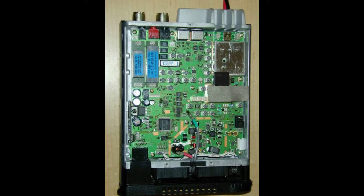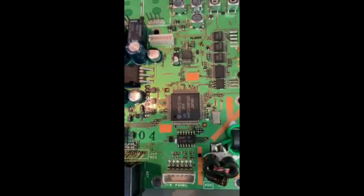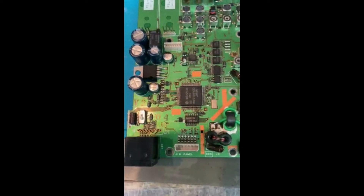Now that we've covered the high-level view, the exceptions, and functionality, let's actually dig in. We want to buy an 857 or 897 and we want to know whether or not it's a D. The best way I know to do this is by actually looking at the main board. If you're in the process of purchasing a radio from someone, it's a simple thing to remove the top cover, snap a couple pictures, and send them so you can confirm what you're purchasing. I'll show you the two physical differences between a non-D and a D 897/857.